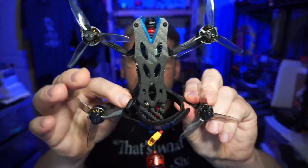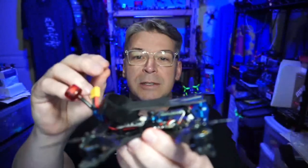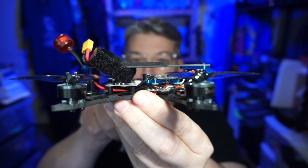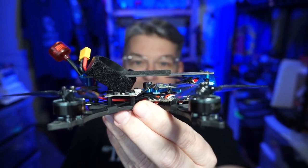I have a disclaimer to make about Avant Quads: I'm a fan of at the very least how they construct their quads. They fly very well too. When it comes to build quality, I find them to be top-notch — always good-looking solder, they go all the way in construction. The motor wires are always secured down with tape, and in this case, see that capacitor right dead center — they designed a TPU mount to secure it to the stack so it's not just dangling around.